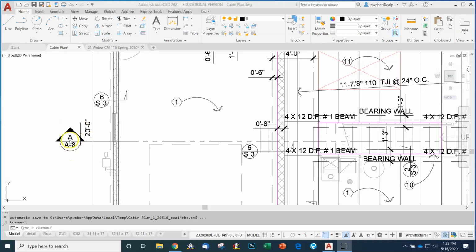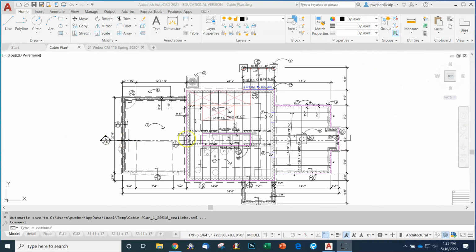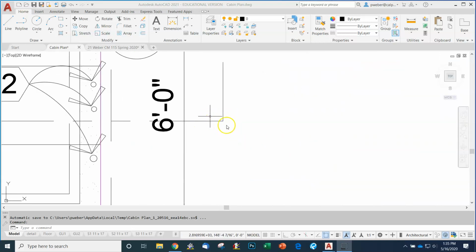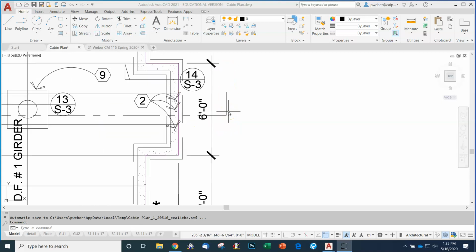You call it section A, and this could be sheet A3, A4, A5, somewhere in the A sheets. Put a 45-degree triangle on top of it. Solid hatch these three areas. Place a solid line here, and a continuous line, and then from here on out create a phantom line, and at the end just put a solid line up straight, and that's going to be the section cut.